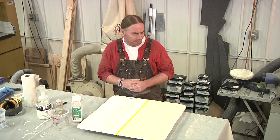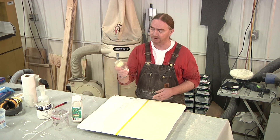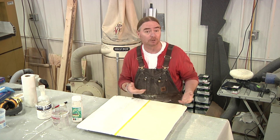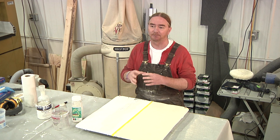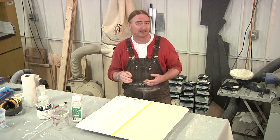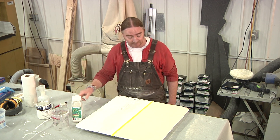Unfortunately my styrene after about 10 years is pretty much a solid block, so I don't have any materials to thin this out. People are going to say you could use acetone, but I personally don't like to thin gel coat with acetone because I think it breaks the material down and it doesn't actually fully cure, or at least cure as hard as it should. It always stays just a little bit soft, and if you over-thin it with acetone it can actually stay a little bit rubbery. So I don't thin gel coat with acetone. I thin gel coat very rarely, which is why this little container has been sitting on my shelf for 10 years — but if I were to thin it, I'd be using styrene.